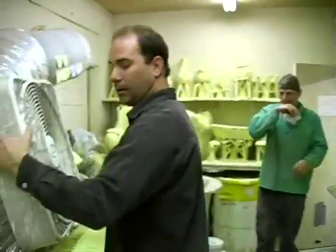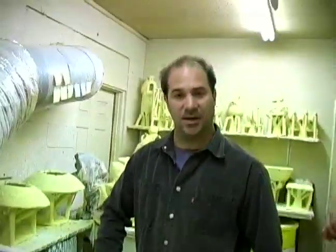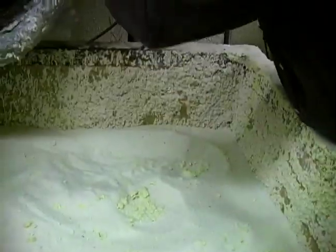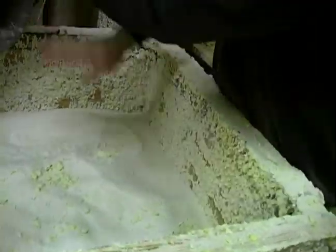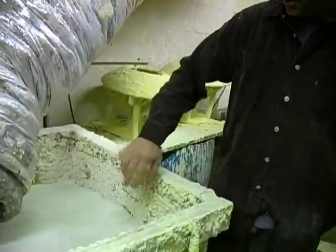Doing a little tour — this is how we do the coating of the sand. Some people just throw sand on it. This is what's called a fluidizer. Just like an avalanche, you can't push your hand into it until you add air. Then it fluffs very nice and easy.